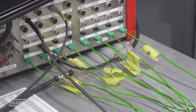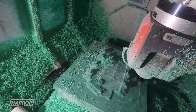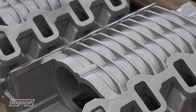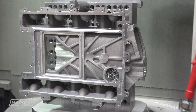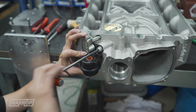Following our extensive testing of prototype assemblies, with all the CAD and CAM completed and signed off, we manufacture our patterns for the sand casting process in-house. Castings are fettled and heat treated to T6 before being supplied back to the machine shop for processing. Our Mazak Twin Pallet Horizontal Machining Centre gets to work on the milling before moving to the assembly team with quality inspection at every step.